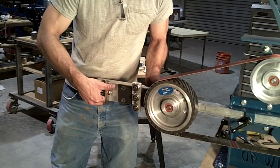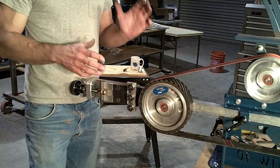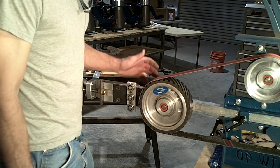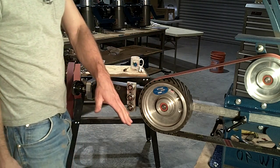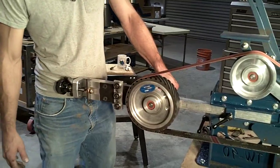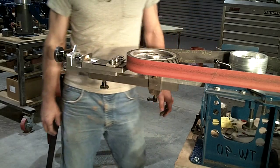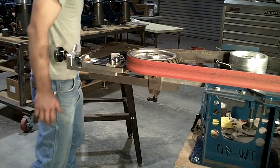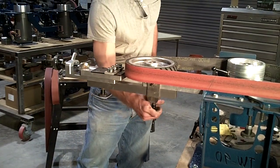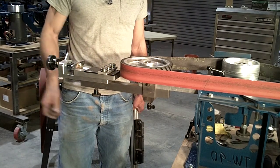This would just plug right in. Now, with the surface grinding attachment for other grinders that are out there, it will be in the vertical sense — with the exception that the adapter I'm making is going to be not vertical, to hopefully not shoot anything into your foot. On my grinder you have the convenience of working horizontally. With that piece applied, I can do my coarse adjustment in and out, and then the rest is a fine lead screw for your final adjustment.